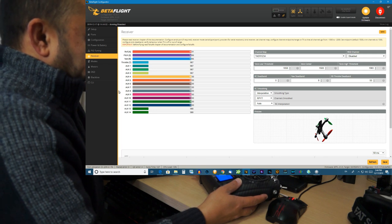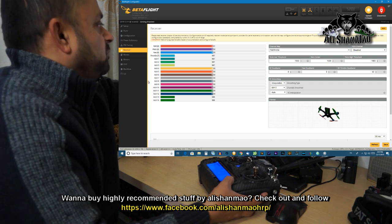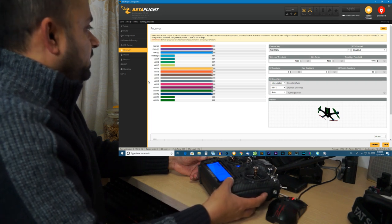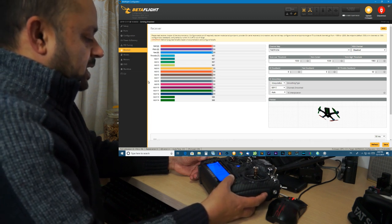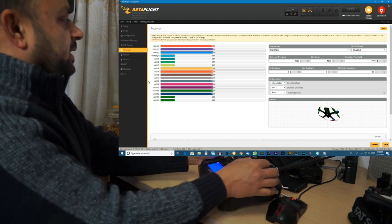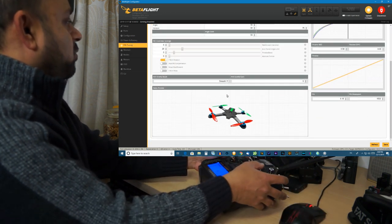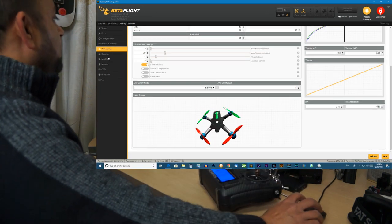Now it's time that I will set the trims. So basically, all you need to do is make sure the value is 1500 here, okay, and you will be fine. 1500 there, matched, and you can see the quadcopter stopped, except that my channel 4 is still not matched, so I'm gonna put it to 1500. Now it's stopped and I have full control. I will go to the PID tuning and see how fast my quadcopter is flipping. Okay, that's fast enough. Alright, now receiver is done.